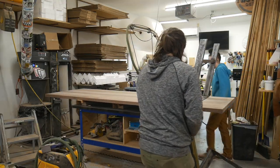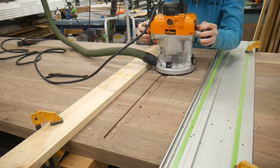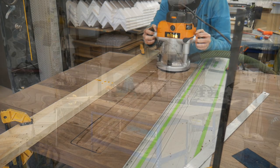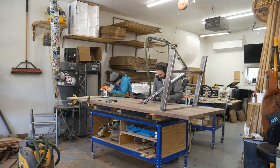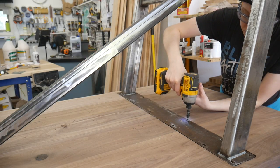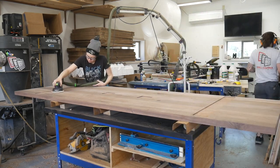Now we're going to get the bases lined up with the table, which involves staring at SketchUp, staring at the table, and just kind of measuring to see what looks right. Once we all agreed on what looked good, Evie got started routering out the channels where the table base will sit so that flat stock doesn't sit above the surface. This step definitely isn't needed but I think it looks way better and it probably took her about an hour. After more test fitting to confirm everything lines up we did a little cleanup passes, but everything fit together great. Then we used a self-centering bit to mark the holes so everything would line up correctly, and we used threaded inserts.